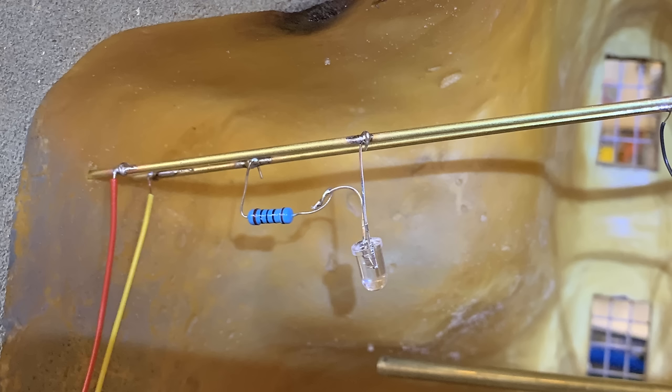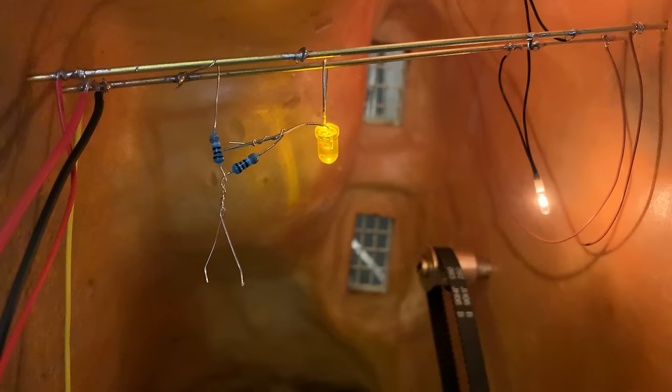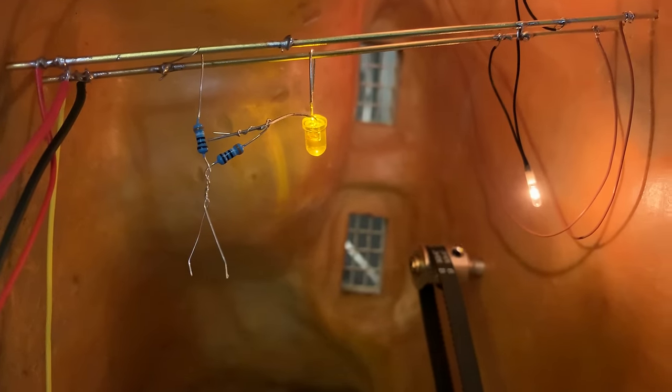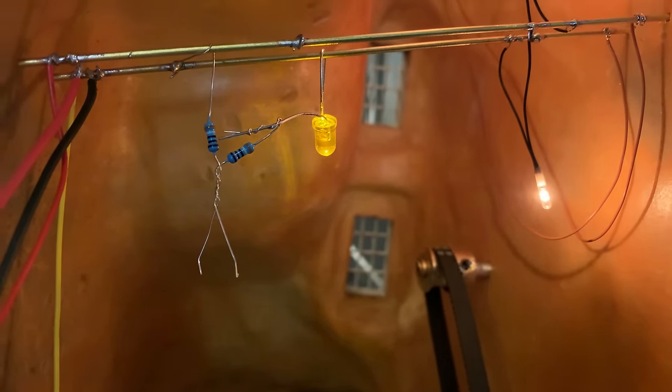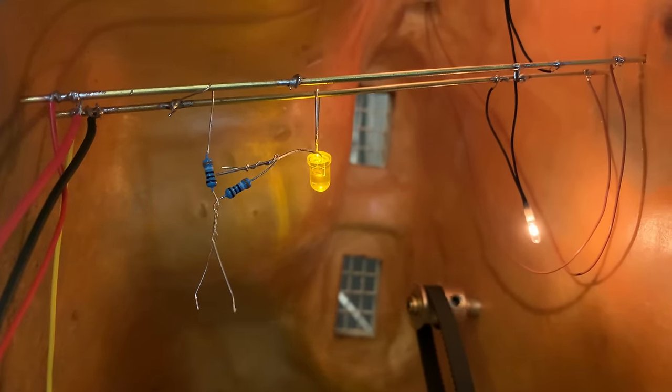You know me, I'm just never happy unless I've completely over-engineered and over-thought something. I thought, wouldn't it be fun to have a slight flickering LED going on inside with the other lights? So I added this LED. As per last week's video on LEDs, that means you have to add the appropriate resistor to the flickering LED — here's the math to make all that work. And then of course there was just a good deal of trial and error, and then I had a flickering LED. And no flames — we have no 120th scale fire insurance.